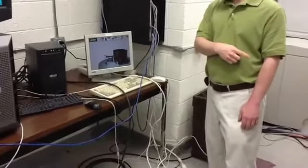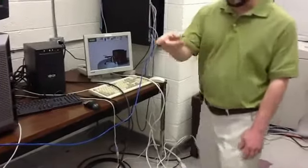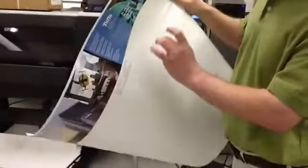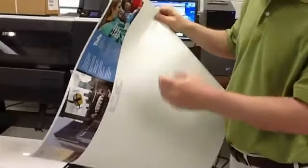So it just got rid of the slip sheet. While that was happening, the proof just finished. It's a full contract quality proof. The proofing software in the workflow, you can put slugs on it, so we have our approval information that will allow us to initially review it, sign off. It has the job name, the PDF, how it was processed. If you want to, you can have individual color bars that can be validated for GRACoL. The whole thing is set up for GRACoL right now.